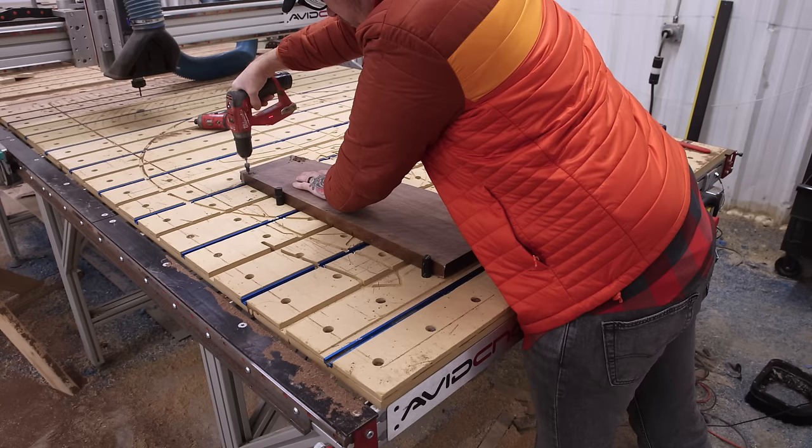I set that aside and got back to something more in my wheelhouse — the tabletop. I needed to carve in an eighth-inch border gap on the CNC, using the same work zero as the original reference scratch to ensure it's properly aligned. Those eighth-inch gaps are so I can pour in black epoxy, which will be my figurative and literal line work — just like the bold line work in the Matt Goad mural and traditional tattoo designs. After pulling the tabletop off the CNC, I cleaned out some of the grooves before the pour and used the old glue-and-sawdust trick to make the seams a little more seamless.